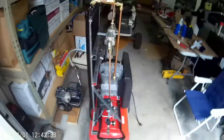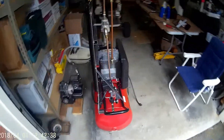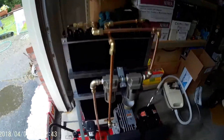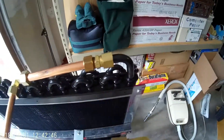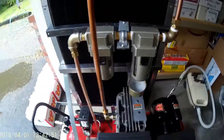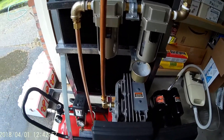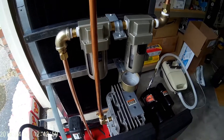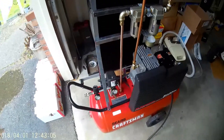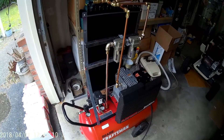It's narrow, it's convenient, and the fan is big enough — it circulates the air. It goes in real hot right out of the head up into the top and comes out nice and cool. A lot of water collection — I've got two filters. The first one collects most of it and it's an automatic drain, so I had to put a little cup underneath it to catch the water because it would go right onto the hot head. So far I'm happy, and it's even quieter than it used to be.